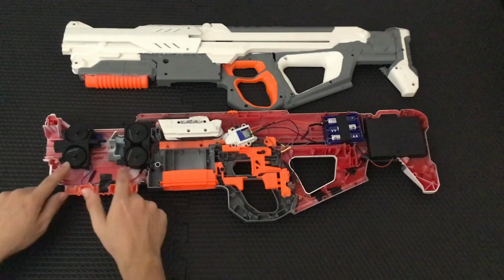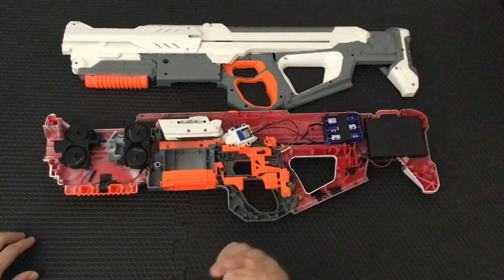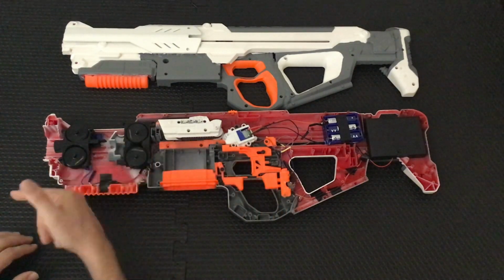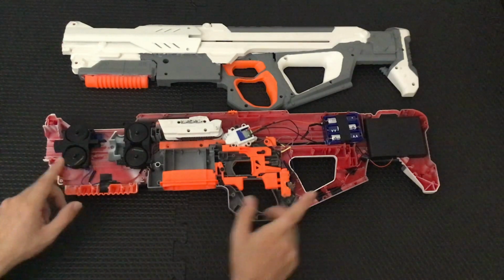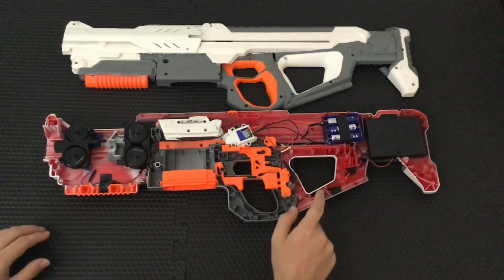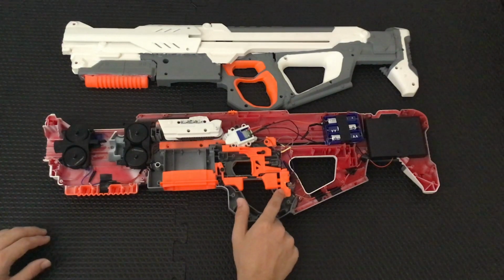The 4 flywheel motors were taking all the juice before the pusher motor could get to it, and by the time I tried pulling the trigger, the pusher motor did not have enough power to push the dart into the flywheels. So I had to disconnect them. I gave the afterburner its own power source. I gave it its own little switch attached to the rev trigger. And that was about it.